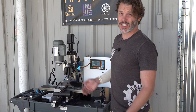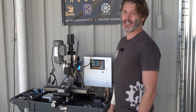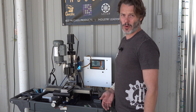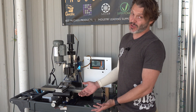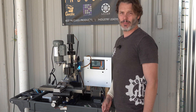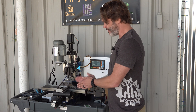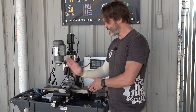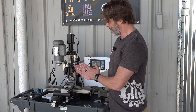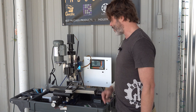It's about a one-minute process for three armatures in there, which is actually a really good cycle time per armature — because if we were doing these by hand, one at a time on a grinder, which is how we used to do it, it takes about a minute each. And then the last pass, we don't actually go in any further, and we do a half-speed pass just to kiss everything real nice, getting any deflection out of the shaft, because the shafts are somewhat flexible, and then it goes out of the way.